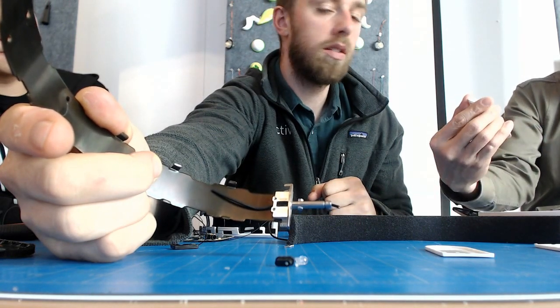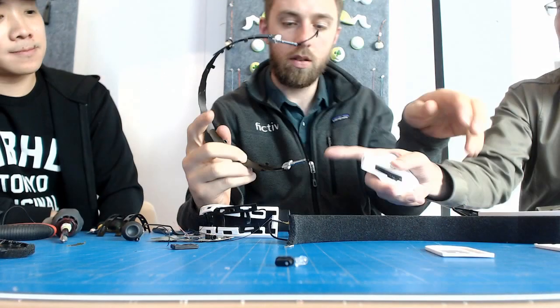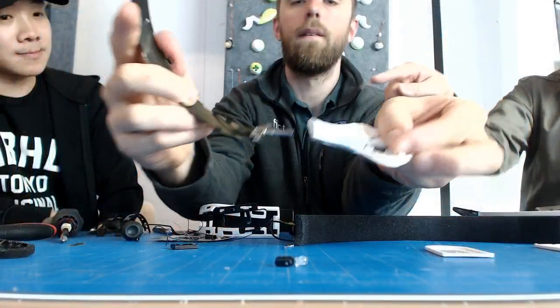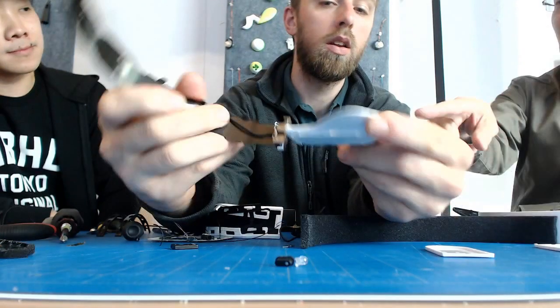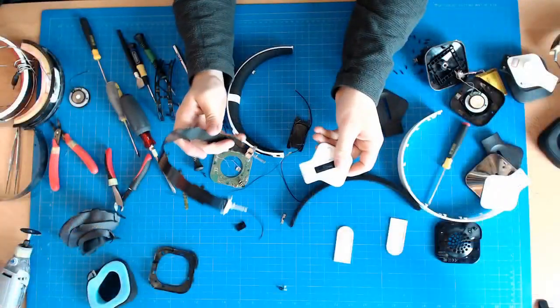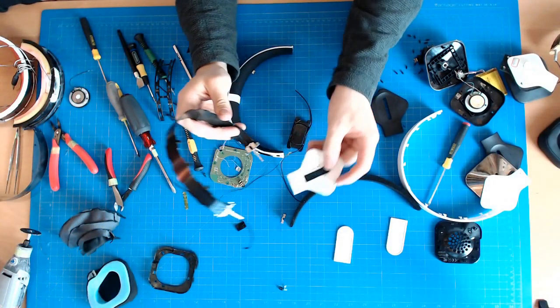And the story here also is because that's metal and it rides in a plastic part, we actually had to replace the plastic with a glass-filled nylon. This plastic here. Yeah, because when we went through the first round of cycle testing, the first plastic that was PCABS wore out in about 500 cycles. So this is a glass-filled nylon here. So I think this is really interesting.